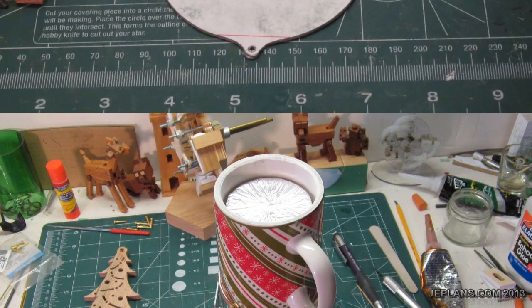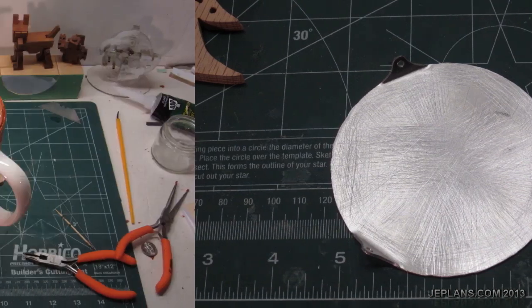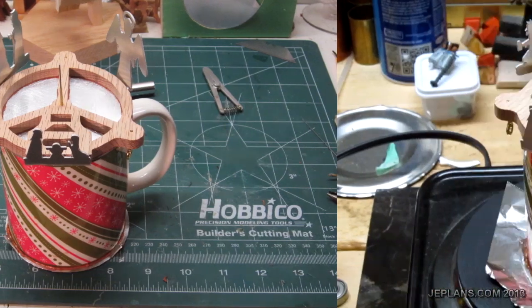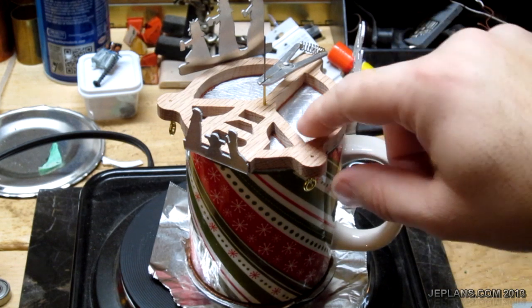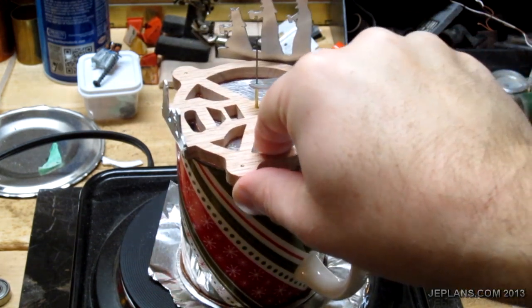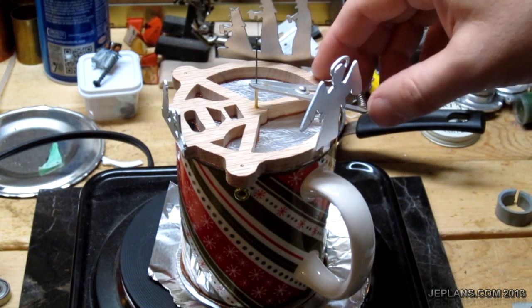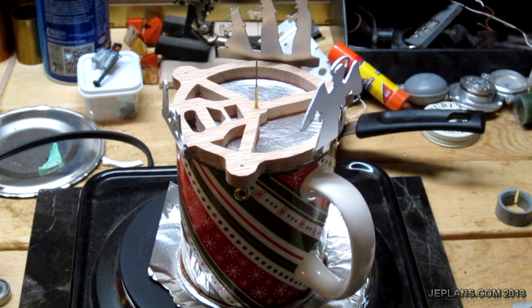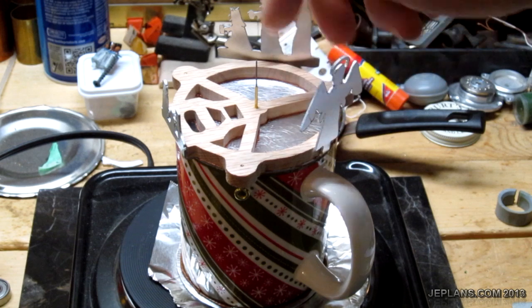Attach the mug to the top, cut out the bottom, bend the tabs and score, then attach it to the bottom of the mug. Take a minute to heat it up and burn off some of the glue before putting the bellow on, because otherwise there's no chance for any of the smoke to escape — it cakes up on the only spot it can get out.